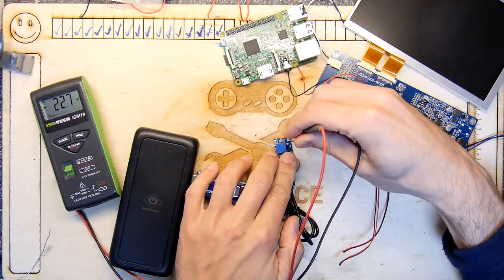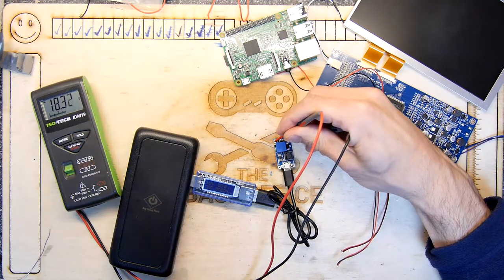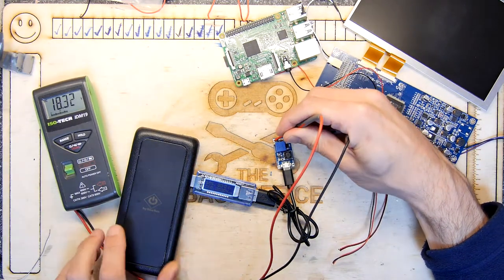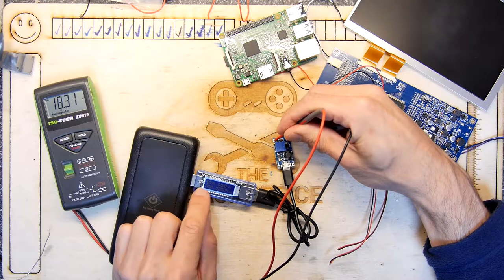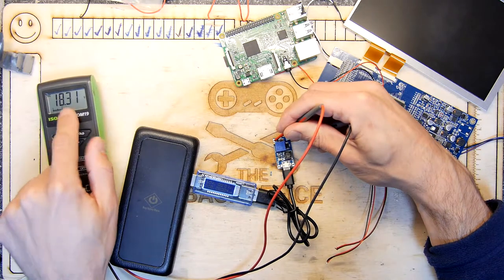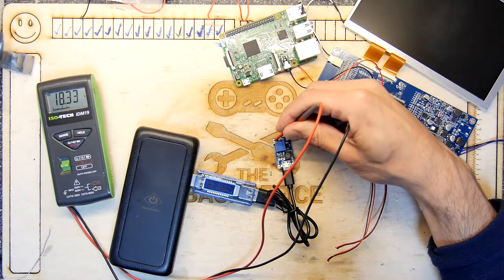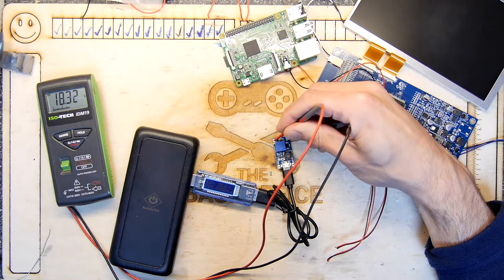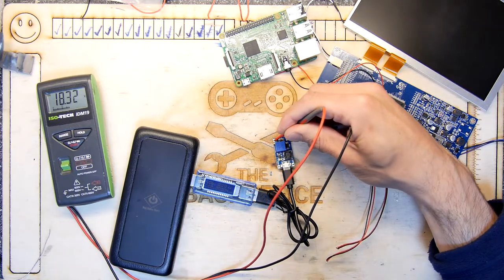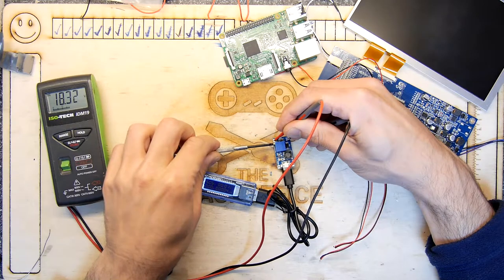Here's my voltmeter, and you can just about see that in the corner of the frame. We're fitting everything in today, keeping it zoomed out, keeping it real. 18 volts — yeah, great. So you can see here — five volts in, zero amps of course — and that's giving me an 18-volt output at the end of this module. It's not going to load though, so what I'm going to do is try to find a suitable screwdriver and adjust this down until I get 12 volts.